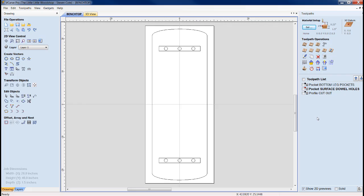What we did first, after we ran our spoiler board tool path, because I told you I do not have a planer big enough to plane anything wider than 13-inch stock on my DeWalt DW735 planer. That's the largest I can do is 13 inches. So I end up using my spoiler board bit on top of my machine as basically a makeshift planer. Well, we're going to say that you've done that step. It's a simple program to cut.